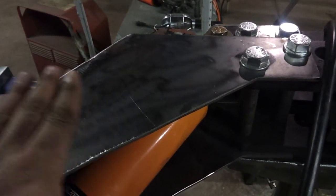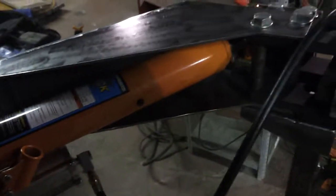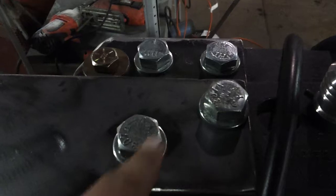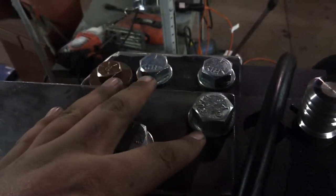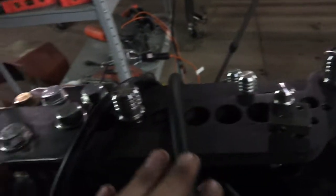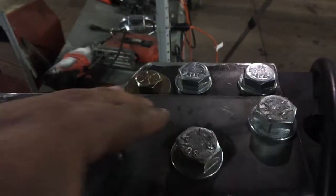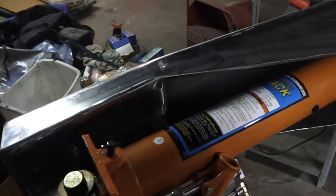Because this is part research and development, I need to find out if boxing in is even necessary. Next week I'm going to get some tubing in and try to put this under load. There's going to be a little bit of movement more than likely where the bolts are — the holes were plasma cut, not drilled, so there's a little bit of play. I figure once I put a piece of tubing through and run it through the bend, it might shift just ever so slightly, if at all. I'll probably do a couple of bends before my final testing.